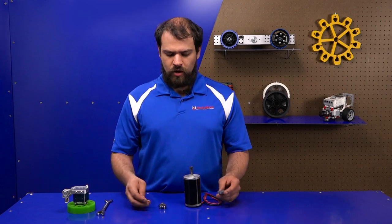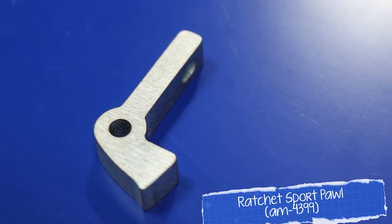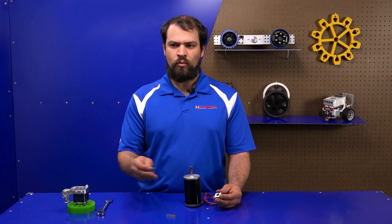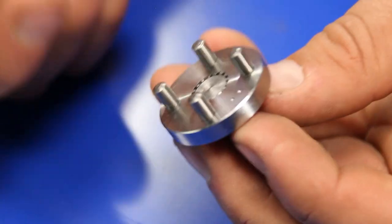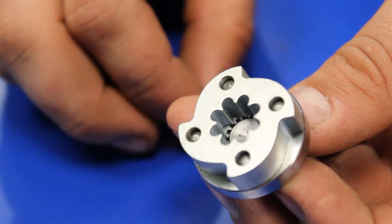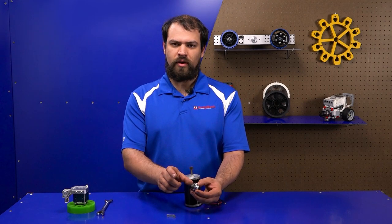The basic components of the ratchet are the ratchet gear, the pawl, and in our case, this carrier plate, which allows it to interface smoothly with the rest of the sport gearbox. These two connect together like that. As the motor spins the ratchet gear, the carrier plate spins in unison, turning the rest of the gearbox.